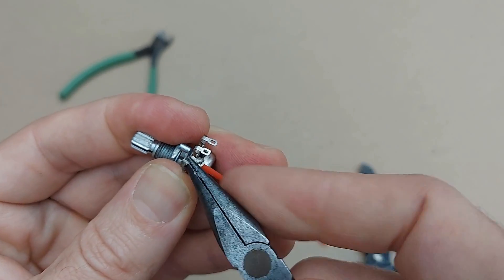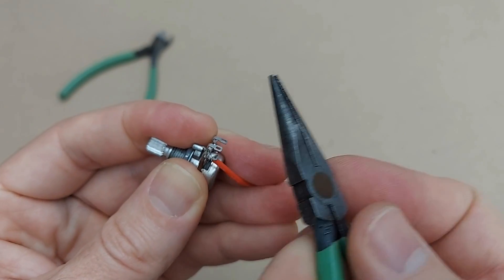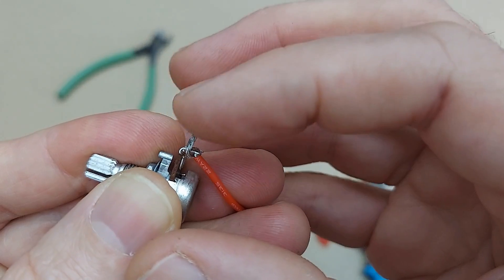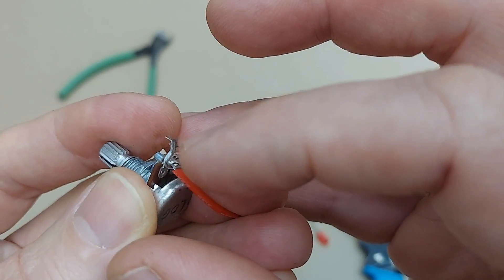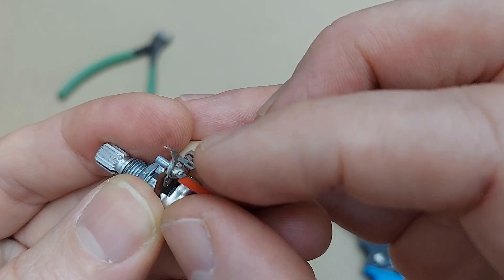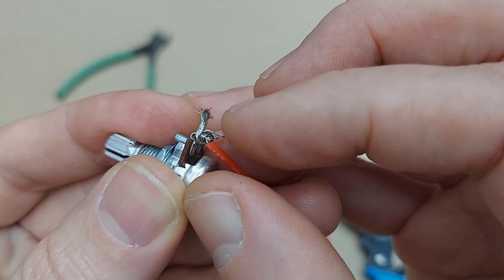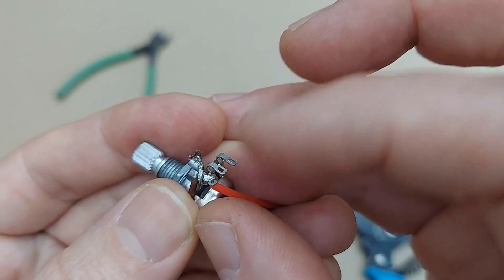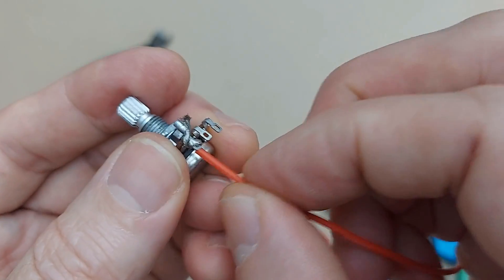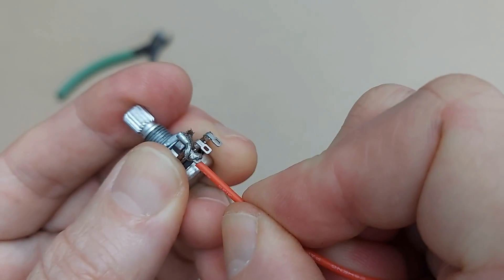After the second wrap, the end of the wire is pretty much toast — you can see it's frayed badly, and I don't really want to use any of that. All it takes is one of these little wires to find its way over to the next terminal and you've got big problems. So I need to make sure that none of these wires are able to make contact with any other part of the component. But this wrap through that hole is very strong and the wire won't come out.